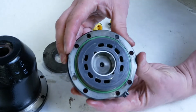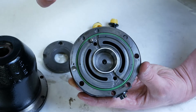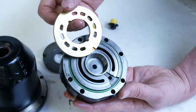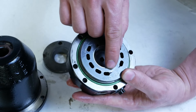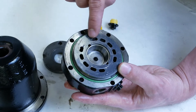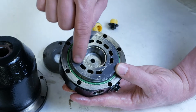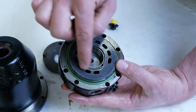Looking at the port plate, or pressure plate, fitted to the end housing — this one is actually pinned in place. There's a pin fitted to a recess in the port plate. The brass surface may look like it's installed upside down, but it's not; that pin fits into that recess exactly as built. We can also see the feathering grooves on the port plate, used to prevent hydraulic locking and cavitation. There are four feathering grooves, two on each side, meaning this motor is designed to operate in either direction.